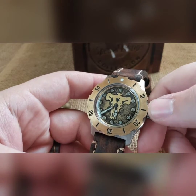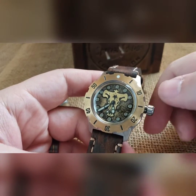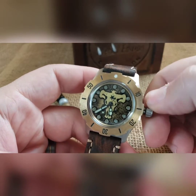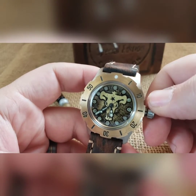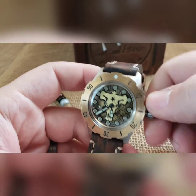Automatic mechanical — you can wind it, you can wear it, you can put it on a watch winder. But if it's dead or you're not going to be very active, you want to pre-wind it. Back the crown off the threads until you're in the wind position — you'll hear it and feel it clicking. A wind is a turn away from you; winding back does nothing.